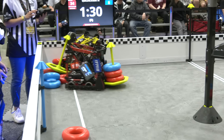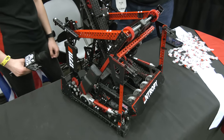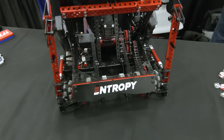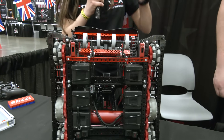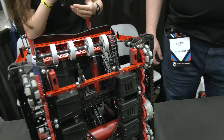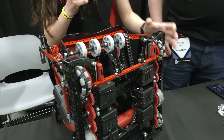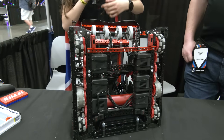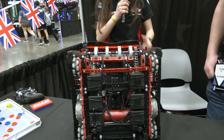Let's dive more into this robot. One of the most useful features I've been using all of VEX Worlds is a double infrared sensor in the form of the VEX line sensor, mounted on the front of the drive base — you can see I've got two here. It's inspired by First LEGO League robots and the way they square up to lines: if one drive side is off, it goes and aligns, becoming parallel with that line. This is really useful in skills because you can adjust the robot and determine the exact position and orientation on the field.